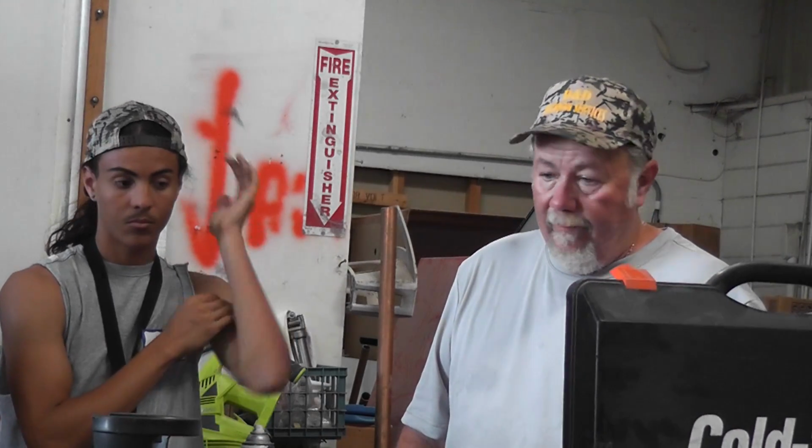Now, this is for emergencies only, and the reason is because that's very expensive. It's $75 a tank to fill it. And a 2-inch line to freeze it in 10 minutes, you're going to fill a tank. But when it comes time, you have to shut the water. I mean, you can't cut a 2-inch water line in a ceiling and put a ProPress on it if you're in the middle of the hallway in the nursing home. So you freeze it, cut it, put a ProPress valve on it, shut it off, come back. Now you don't have any water running, you're not flooding out a hallway. So that's what this is for.